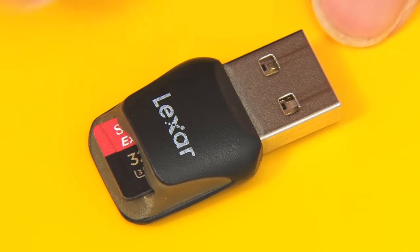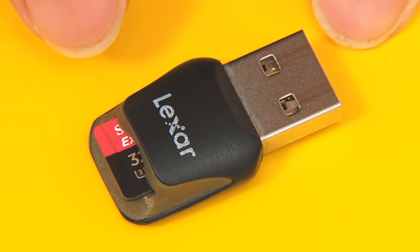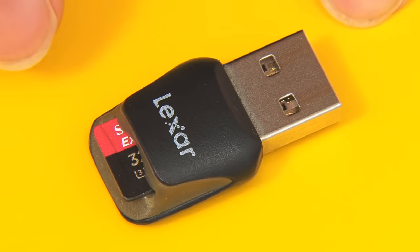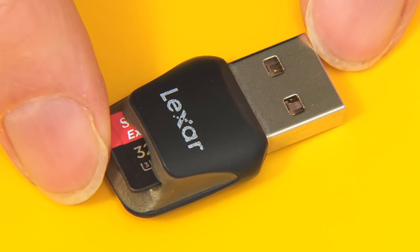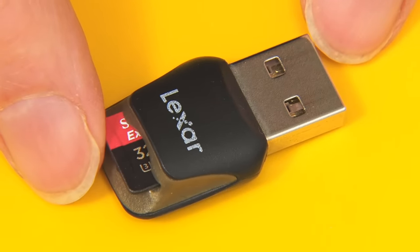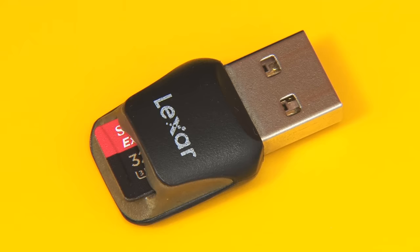And I do find this very handy, because although lots of devices have got microSD card slots, they're often not very fast, and larger devices tend to have SD card slots rather than micro still, at least mine do, so I'm often looking for an adapter like this. And I often use this in particular for imaging operating systems to microSD cards for testing on single board computers. So this has become a little bit of a friend over the years. I'd feel rather sad if I couldn't lay my hands on this particular hardware device.